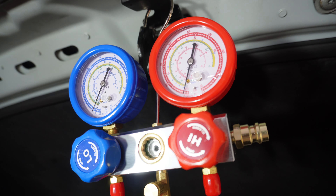I've turned the manifold on with all valves in the open position and the vacuum pump is now on. After 15 minutes, you can see the gauges are reading minus 30 on both sides. What's going to happen next is I'll turn the pump off, and in theory both gauges should stay at minus 30 for the next 15 minutes or so. I'll come back in 15 to 30 minutes and check. If we still have minus 30 on both sides, that confirms there is no leak in the system — the system is under vacuum.